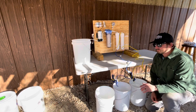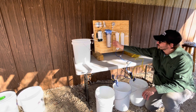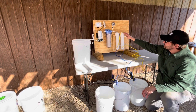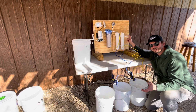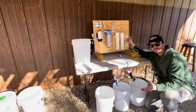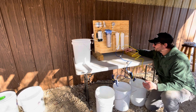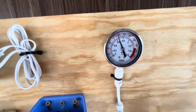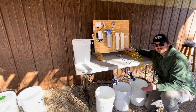So this is the system. I have raw sap in that bucket getting pumped through a pre-filter, and then it hits membrane one and membrane two. I was going to have three membranes, but when I started the system up I realized the third membrane had a crack — it was dumping a ton of water out of the pure water outlet. Either the housing was cracked or the membrane was cracked. When I removed it from the system I'm now able to maintain 100 PSI.